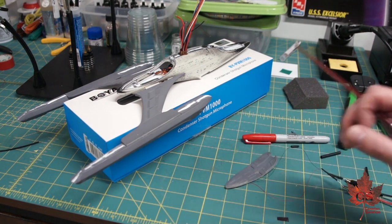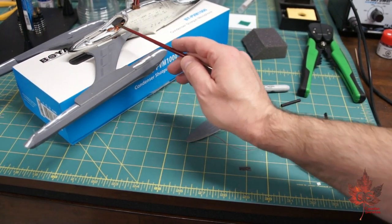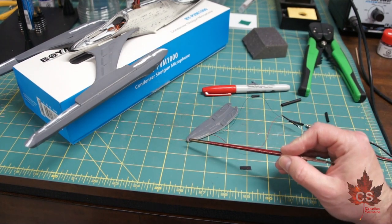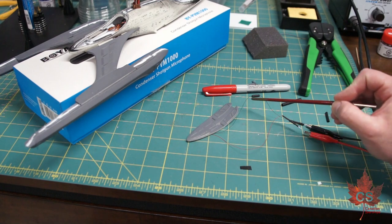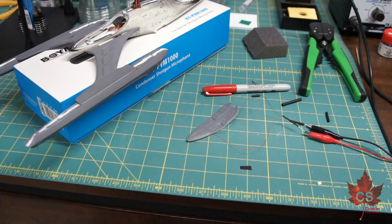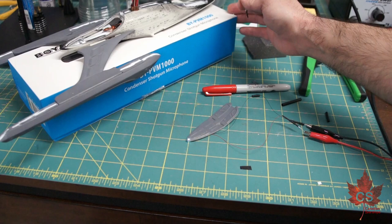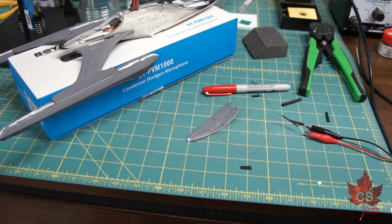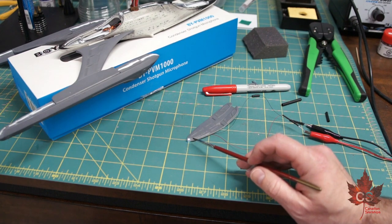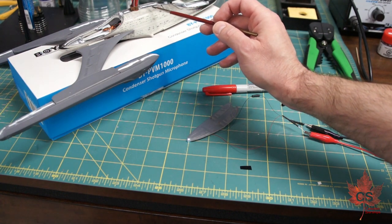What I want to draw your attention to is this piece which goes into here — there is a little tiny aperture drilled here and you can see the wires from the 0402 SMD coming in underneath. That has been installed and when I turn on the power supply, that's a really nice nav light. The one going back there is going to be on the solid light circuit — not flashing. Then the one that goes just ahead of the stand will be on the flashing circuit. This one's been fully installed. I just need to do some sanding along the seam before I can get that underbelly flasher installed, and then that is the last LED that has to go into this thing.